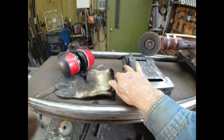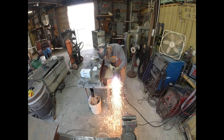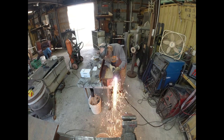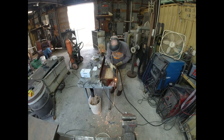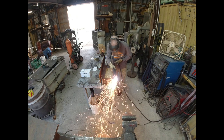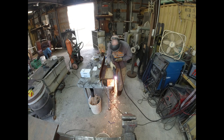I might put it all the way on the outside, not sure. I dragged in a little piece of that I-beam, or the wide flange beam, whatever you want to call it, from outside, and I'm cutting off the flange to use underneath the cast iron part. I'm trying to cut as close to the flange so I don't have so much to grind, but I ended up with a pretty good grinding job because you can't really cut this perfectly.